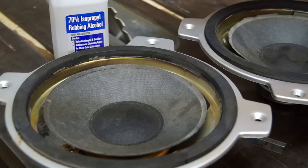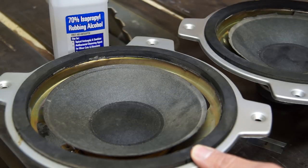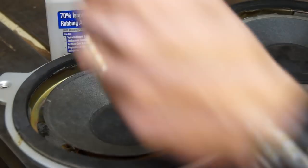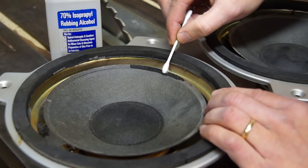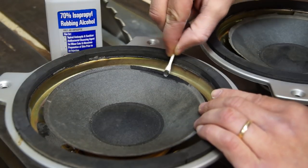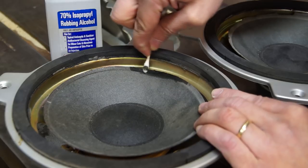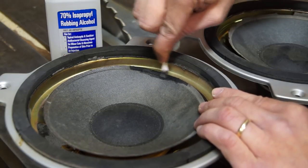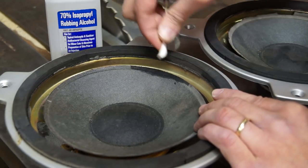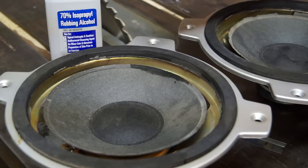On a side note, I'll show you how this works on a driver that's a little newer where the foam isn't just falling apart. For this I'm going to use isopropyl alcohol — I'll put a little bit on a Q-tip. It just needs to soak in. Soon enough it'll actually start to dissolve the old foam. You may need a paper towel to keep it on there longer. The old foam that was left on this driver is just dissolving into a gooey puddle. Wipe it up — it's gone. Do that all the way around and you're ready to put the new foam on.